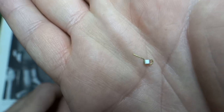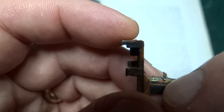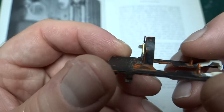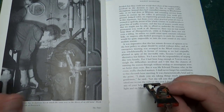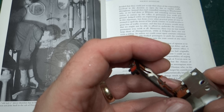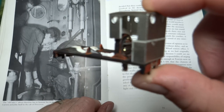It's not a lot of progress, but all those parts had to be made, cut, and shaped by hand. The sight glass I've tried to do like it is in the picture - it's not just a little bit of circular tubing stuck on, but a piece of tubing with a wire running down the tube, and the wire goes into the back head top and bottom, folded over to hold it in place, which means it stands proud slightly of the back head as it does in the real photo. I decided not to bother trying to model the two taps - they'd just be so small you wouldn't see them when looking through the cab doorway, especially when it's all painted black with possibly a driver figure in there.